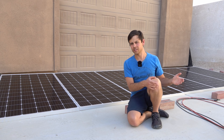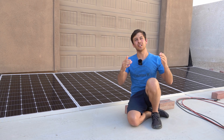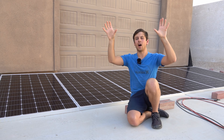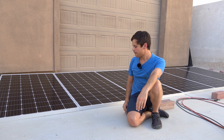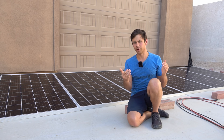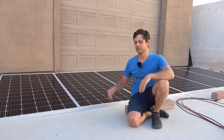On all of my previous systems I had them on RVs and they would be parallel to the ground, and I would still produce a lot of power because there is less atmosphere that the photons have to travel through when the sun is high above your head. In this configuration I can typically get about five hours of peak irradiance every day. If I did spend the extra money for a sun tracker and tilted them perfectly, I'd get maybe six or seven sun hours a day versus five — which means I can easily offset that by just adding more solar panels to my array.